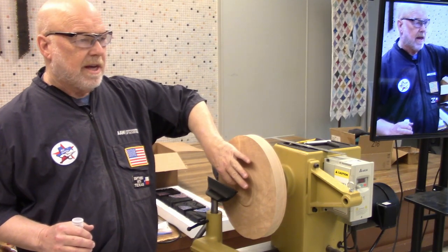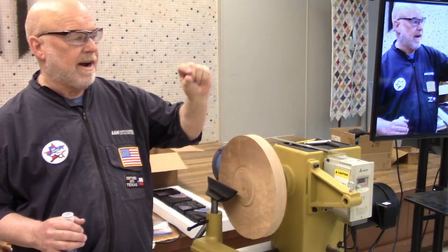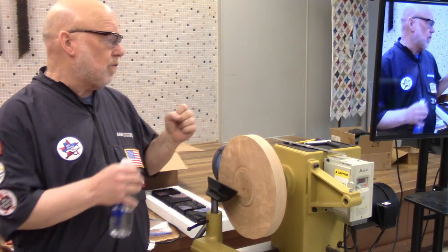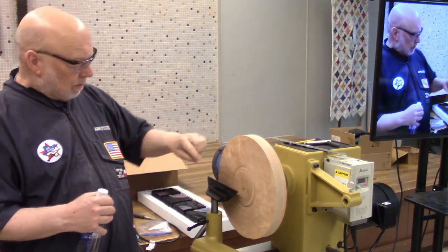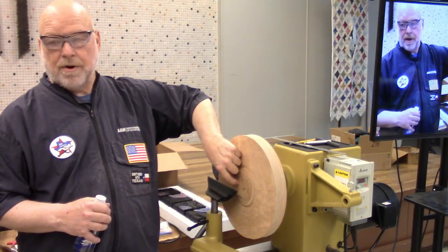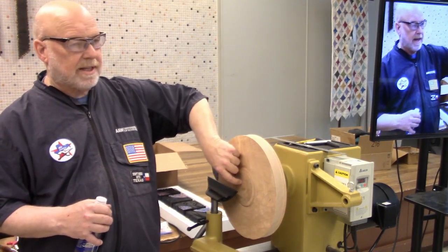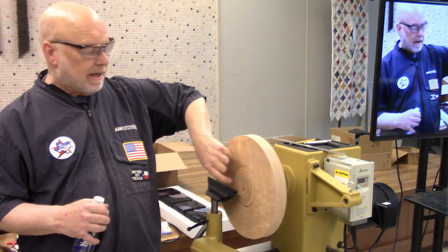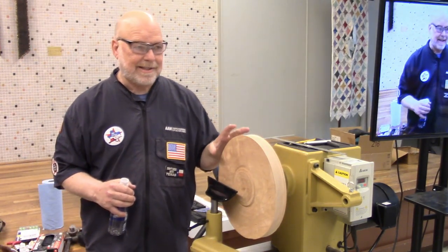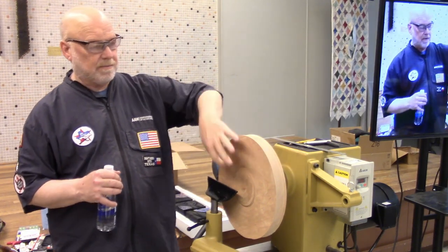Am I making sense? If you make the area between your foot and the recess very narrow, you have a high opportunity of splitting out that foot when you expand the jaws. So you need to make sure, first of all, the foot is deeper than your recess, and that your recess has got some meat behind it. Now, I'm not going to crank this thing on the recess that significantly, but it's a general rule of thumb: you got to give yourself some space.